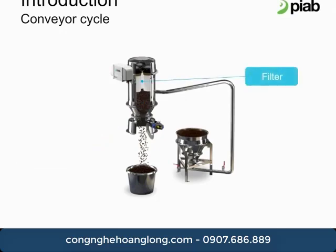Product fines and dust are kept in the receiver by a filter. Only clean air flows through the pump and out the exhaust of the pump. A filter pulse or shock tank blows product off the filter with every cycle. This ensures maximum airflow and efficiency.